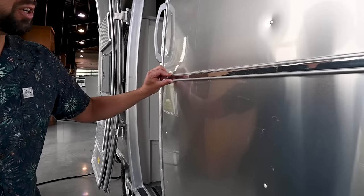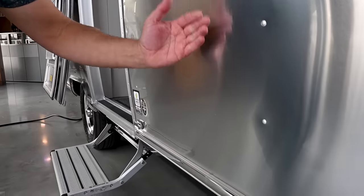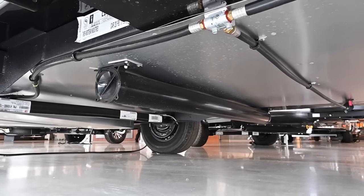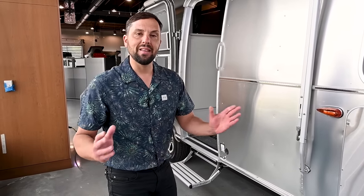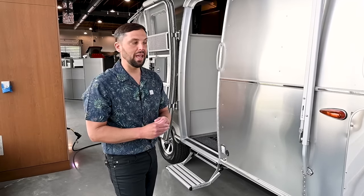There's a belt-line protection in the middle where the two seams overlap, and a rubber rail protection where the side sheet meets the underbelly. It also has heated tanks and an enclosed underbelly with insulation, all wrapped in aluminum. The tanks sit in a little aluminum box with heat going into it, giving you threshold protection for cold-weather camping.